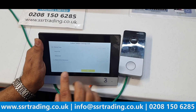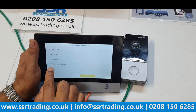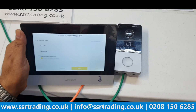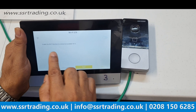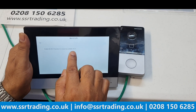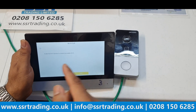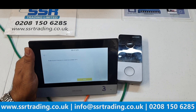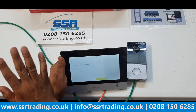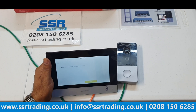Set the indoor station room number to 1. It will ask for a registration password — use the same as your admin password. Click Next. You'll be asked about enabling the WiFi function. This screen can connect to WiFi, but we highly recommend using the wired POE switch connection instead. You have the choice, but we recommend staying with the wired network.